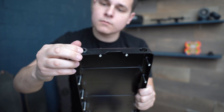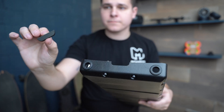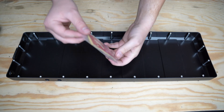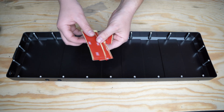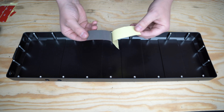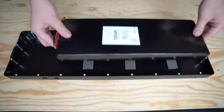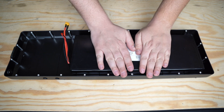Next add each of the included rubber grommets into each of the phase wire holes. This specific enclosure comes with a cable cutout for DIY builds, but in this case we don't need it, so we'll install the gap cover to keep out as much water and dust as possible. Next find the bag of adhesive strips. Stick three of the large strips on the raised sections of the enclosure on the far side away from the cable holes. Peel the backing off each adhesive strip, then drop the battery in and stick it to the adhesive. Press down firmly so it will stay in place.